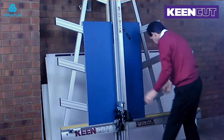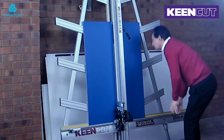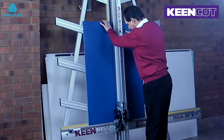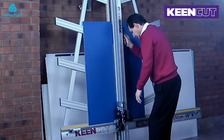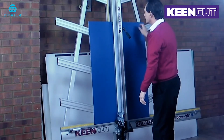Count the number of turns you make to gauge any further adjustments that may be needed. Turn the squaring adjuster knob and check where the machine will cut using the sightline strip as a guide. Make sure the board stays in contact with the squaring arm. Move the board along to repeat the squaring test.